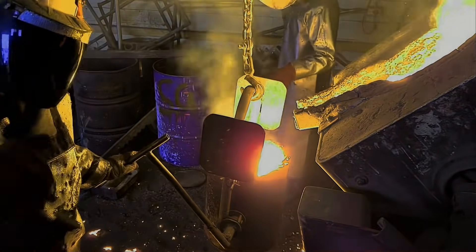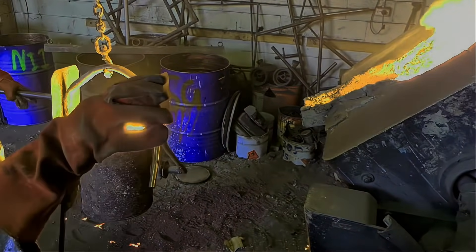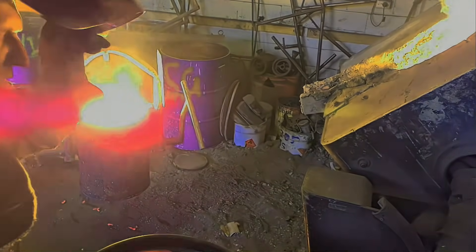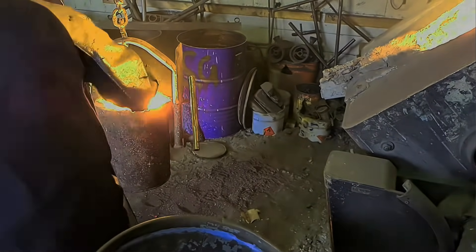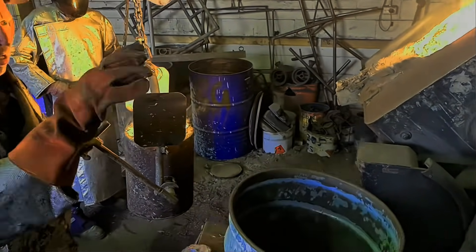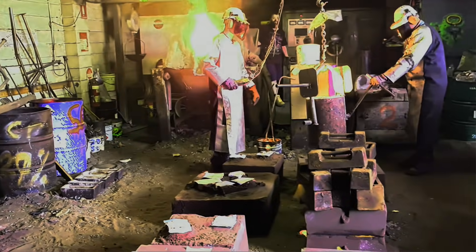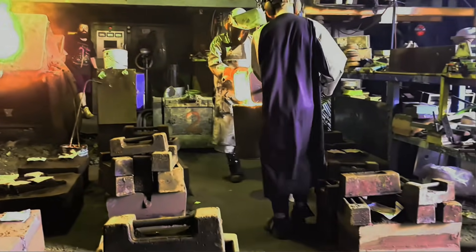Even through the screen, I can still feel the temperature through the visor I have. I'm just throwing a bit more clean-o-met on to purify the metal. No, I won't stir it. As it pours into the ladle from the furnace, it's mixed enough. Just the turbulence that that causes from one vessel to the other, it'll be 100% mixed in. I've just put the slag off on top. I like to stir it just before I take a sample. I stir a lot of my cast iron, but with steel I don't really have to stir it that much because the weights are quite similar and it'll mix easily.